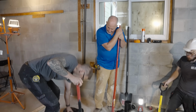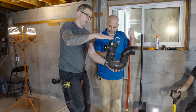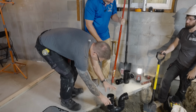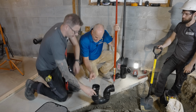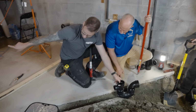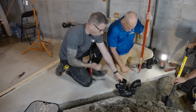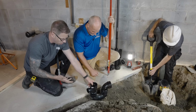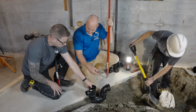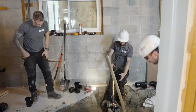Yes. And the idea is we pick up this extra fitting on the side right here. Okay. So this piece will come up and be level with your floor. Right, and so that'll always hold water to keep the sewer gas out? Yeah, exactly. And then this guy is going to come across and over to there. Okay. And it's going to pick up the condensate liquids from any HVAC systems, hot water tank blow-offs, HRVs. So that's ideal then, because we're going to have water coming in on a regular basis, so this never dries out. That's right. That's pretty good. Now we can roll this up.